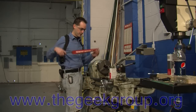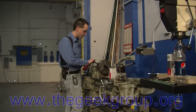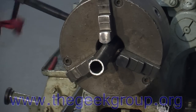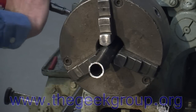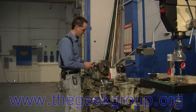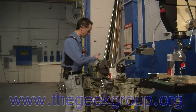This is our T-bar with our RBF tag on it. One of the most common and incredibly dangerous things to do in a machine shop is to leave the T-bar in the headstock. This is a wrench — it's like a chuck key, basically — and you use this to tighten it. One of the most common ways to screw up a lathe and really hurt yourself is to leave this in the lathe. It happens all the time. When you turn a lathe on, this will slam down into the rail and mess it up really good. So I put an RBF tag on here to remind people in a nice big obnoxious red way to take the key out of the lathe.